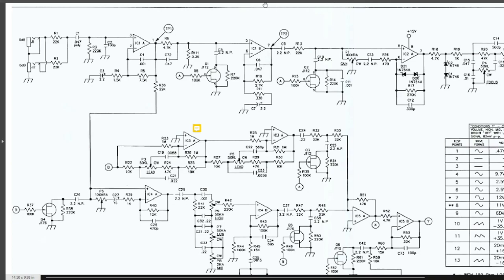But anyway, I think the output of A is being sent to the inverting input of B. And then the output of B is being used in a feedback circuit to control how much amplification comes out of B, sorry. I did, in resistance mode between pin 1 and pin 7, move around the lead potentiometer a bit. I didn't see much movement just right in there, but anyways, this is kind of reminiscent to me of maybe a buffering circuit. I don't know, where you're just trying to keep a constant threshold or amplitude out of one side of the amplifier.